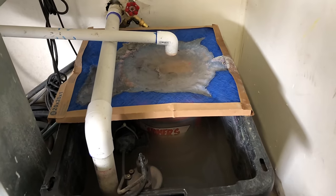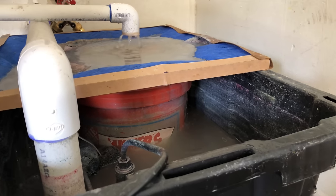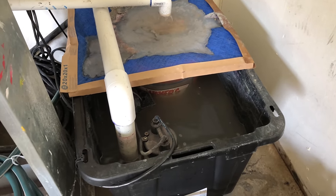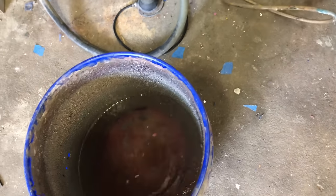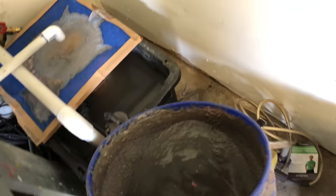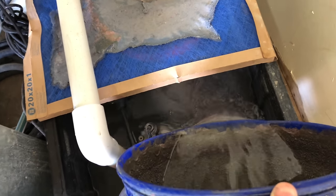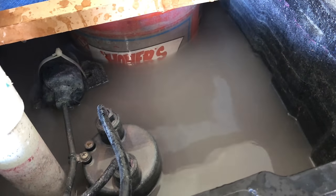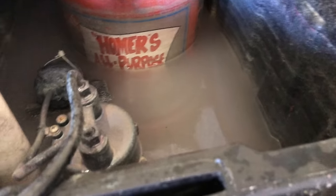And I'm going to demonstrate how that works. As you're using your washout booth, the water just drains out and goes through the filter, and it only flows on the side of the bucket. I'm going to speed this process up a little bit and fill this container up so you can see the sump pump kick on and how quickly it just evacuates the water out of this container. Toss some clean water in here. As you can see, it pretty much sucks this container dry pretty quickly.